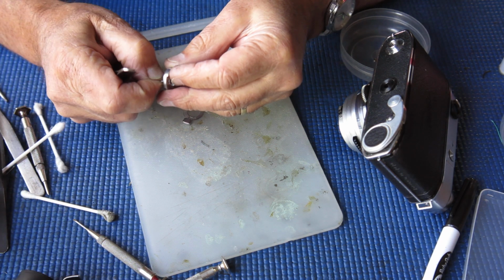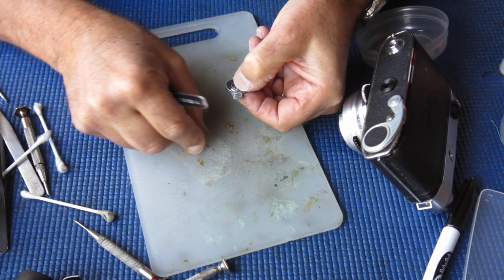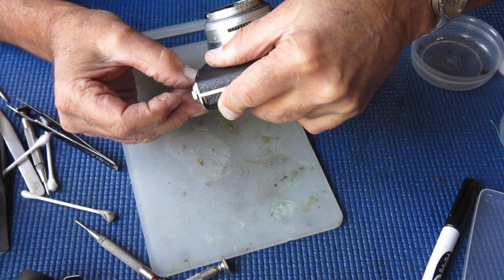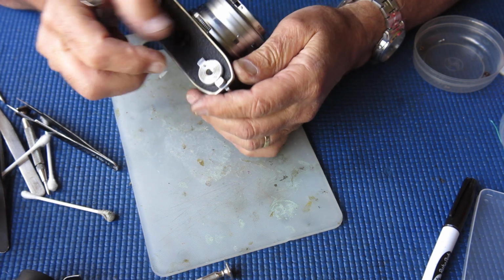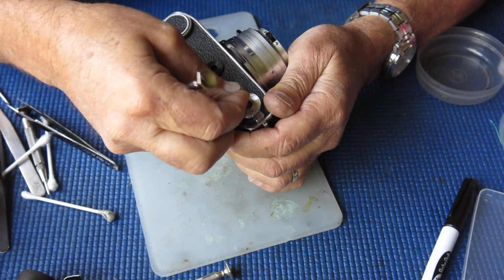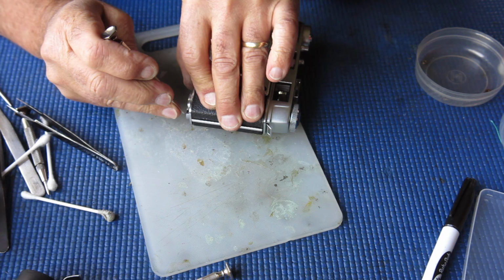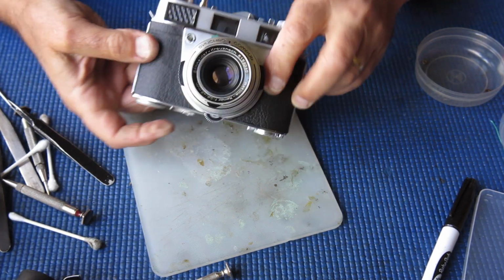Take one screw, put it through the cover, fit the catch and catch cover in place. Fit the spring against the screw and against the tab on the swinging cover. Lift that carefully over the tripod socket. Run that screw home, check that the lever moves. Put the other screw in place. Tighten that screw and the first screw. Check that the lever moves. Something's rubbing somewhere. That catch cover is slightly pushed in at that end. That's better. That's fine.